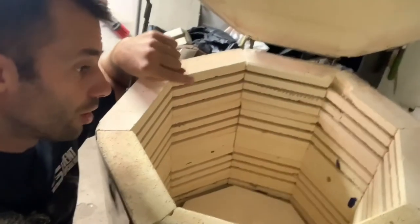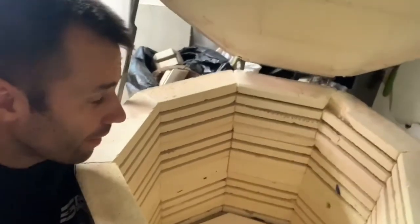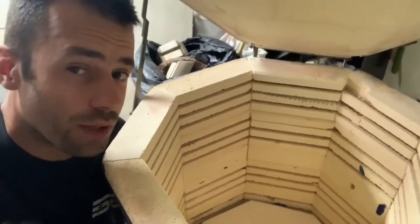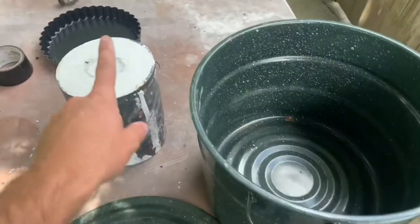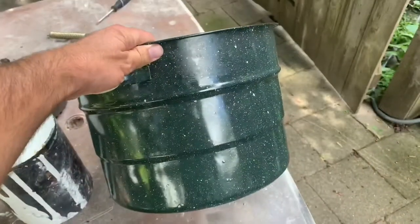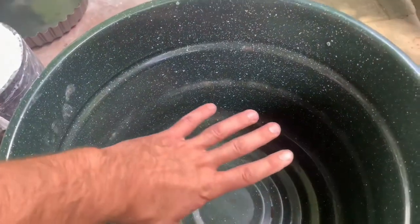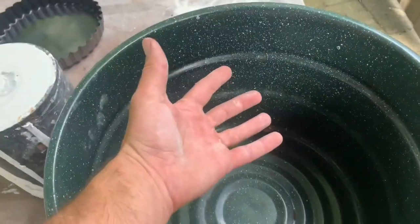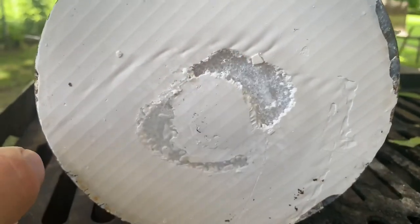The kiln I got is an open coil kiln, and I'm learning that if I burn out all my wax in there, it's not really good for the elements and it won't make the kiln last as long. So I'm going to use a different method called steaming. I got my wax in the investment and I got a big stock pot from a second-hand store. I'm going to put water in there, elevate the mold so it's not in the water, and then steam it so all the wax drips out and pools in the water. This foam plug probably won't melt from steam though, so I'll torch it out.